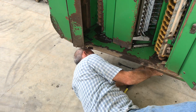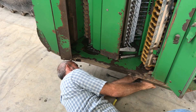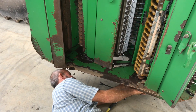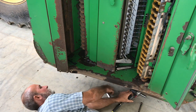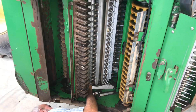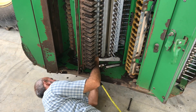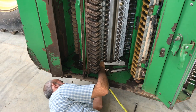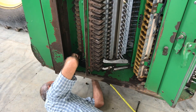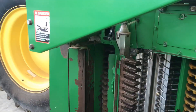Here's Gary hard at work, just taking the bearing cups off the bottom of the doffer columns. There's a big bearing down there — we grease it regularly — and that's what the doffer column spins on. If they go out, it's bad news because you don't want any kind of spark on a cotton picker. Sparks make fire. When those go out, sometimes they cause a spark to get blown up into the basket or the accumulator and you'll be on fire. Cotton is extremely flammable.